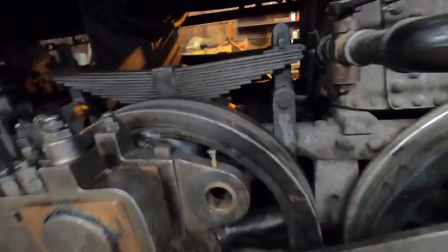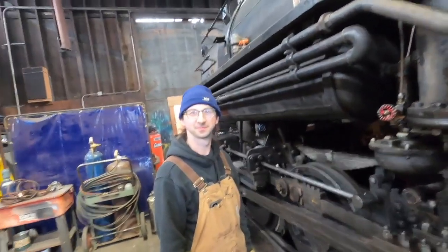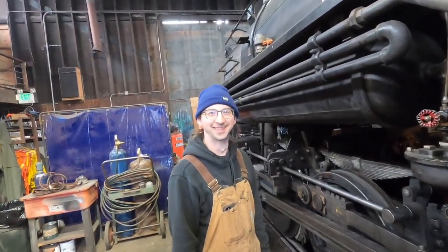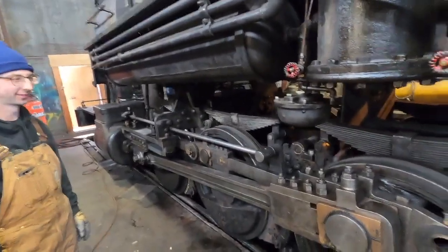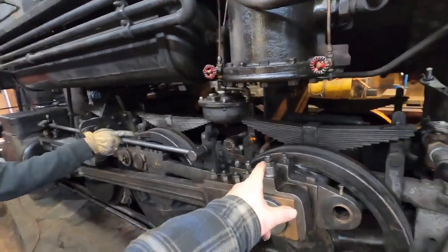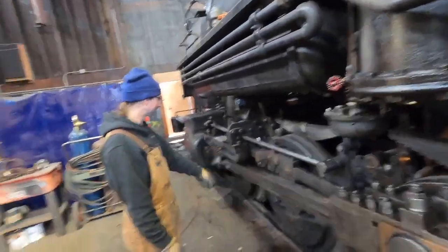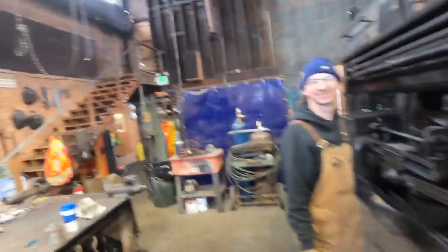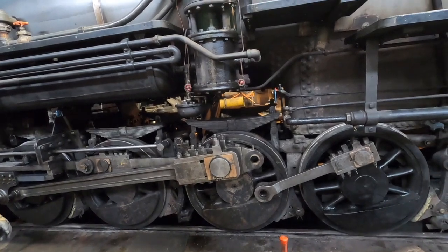Chris is gonna take some detailed measurements of that thing and let us know just what it looks like. And that will tell us the level of repair we have gotten ourselves into. Because if we gotta take that strap off, we gotta take the main rod off, but while we're in there, we do that brass, which means we're gonna end up having to do that brass. We're gonna walk our way all the way down into the locomotive. So get that measured up, tell me how round it is, and then we'll go from there.